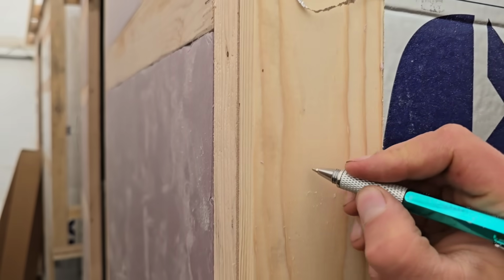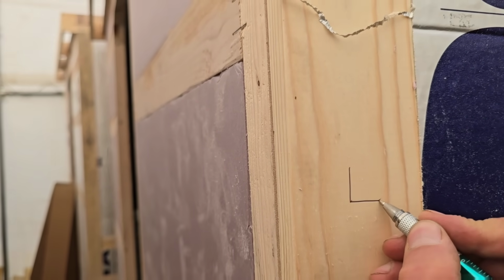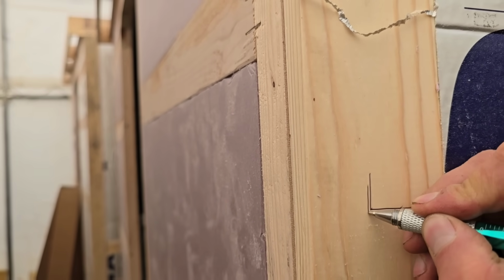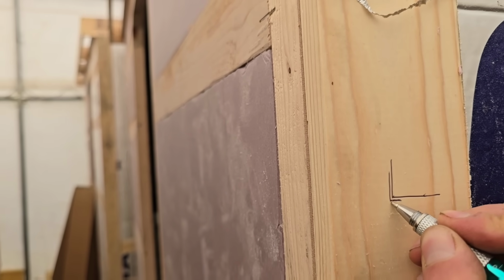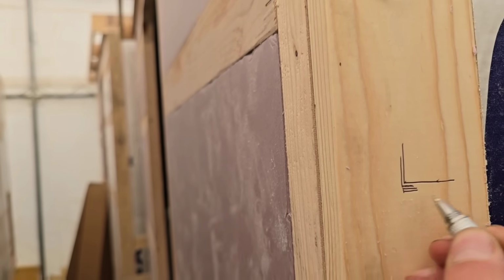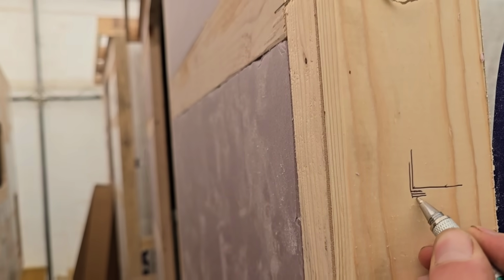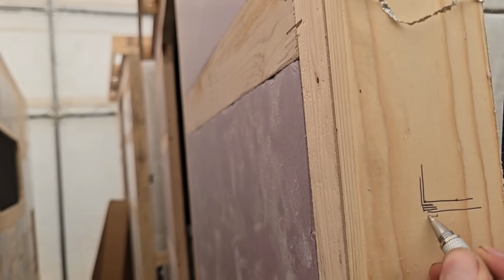I'm going to draw it. You have your camper sitting like this, right? And then you have your metal that sits here. And then you have your sealant that sits here, your putty tape. And then you have your metal again. It comes over and it sits right here. And then you have putty tape that wraps this entire corner.